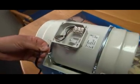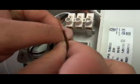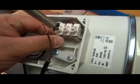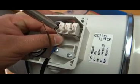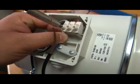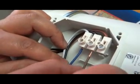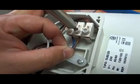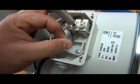Now, very simple: you take your neutral and insert it into the neutral connection point, which is the furthest one to your left. Make sure that you properly fasten your cables. In this case we are going to connect the live to the high speed of the fan, which is the point marked LA. That is your high speed of the fan. Make sure it is properly fastened.